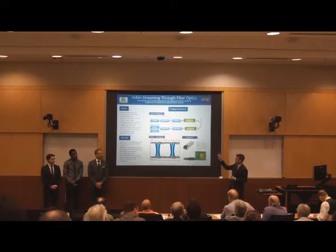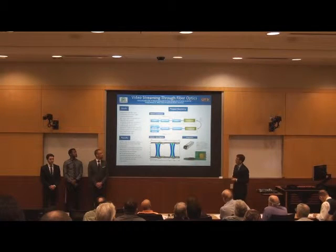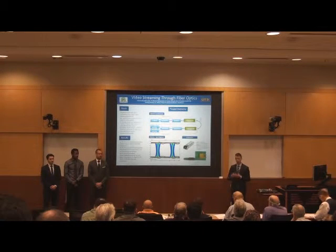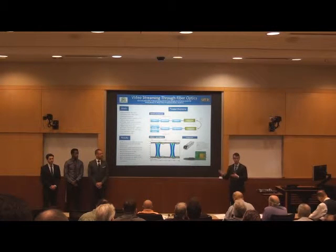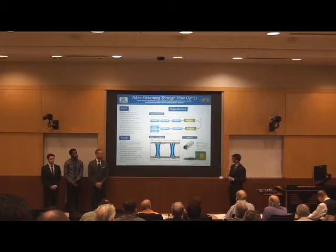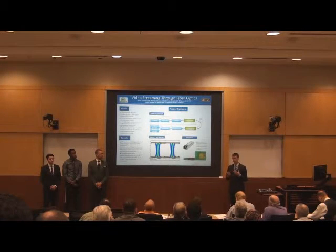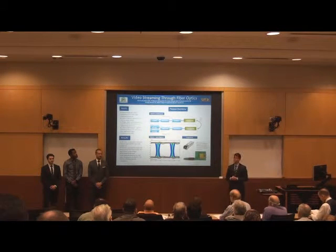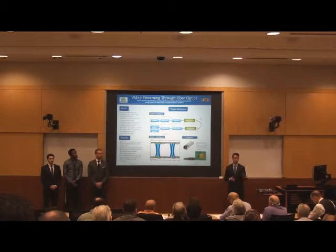You can see the completed system here in the system flow diagram. From the GoPro camera, we capture the stream on the Mini-ITX motherboard. That sends the stream via Ethernet to a switch. Our custom PCB integrates the MicroPak transceiver to the switch. The data is sent across a multi-mode fiber optic cable and received by another transceiver. That data is converted back to Ethernet and sent to another Mini-ITX motherboard running an RTMP server. This acts as the destination of the stream. We take this captured stream and display it to a high-definition monitor, and we can also control the GoPro camera from this location.